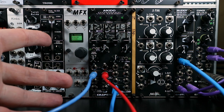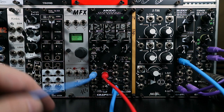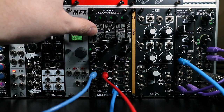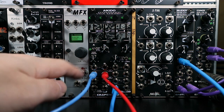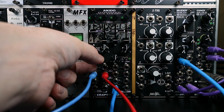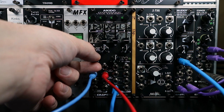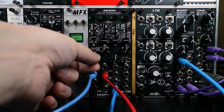An envelope follower plus a VCA is essentially the recipe for creating a compressor or an expander. If I turn up the VCA on channel one, that signal is what the envelope follower is listening to, and the CV input will be the output of the envelope follower. Applying a negative attenuverter gives us a compressor. Turning the level down a little and turning the attenuverter up so dynamic peaks open the VCA more, we get an expander — the naturally louder parts get louder and the quieter bits get relatively quieter, so we get more of the attack, less of the room sound.